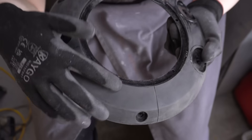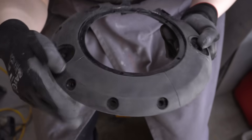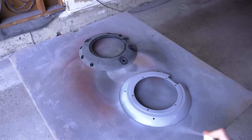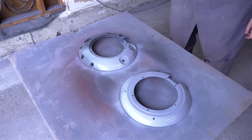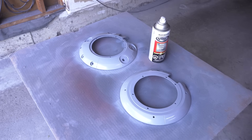I've already done an entire round of smoothing before I've even gotten to the sanding process, which means just after one round of sanding my parts end up looking something like this. Already the layer lines are basically non-existent, so hopefully we won't have to do a whole lot more work on these parts after a couple of rounds of filler primer. Even if you don't have the ability to use ABS at the moment, doing a really good first sand and then some rounds of filler primer will still give you a really good result. Using a smaller layer height on these parts also helped out.